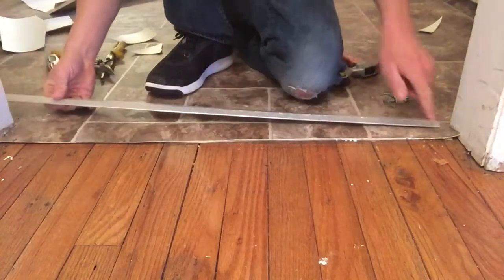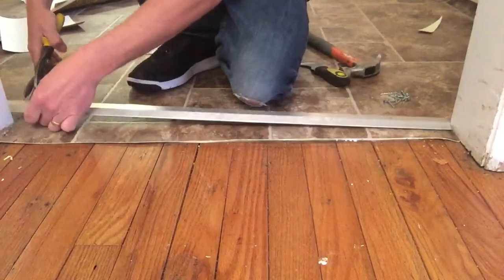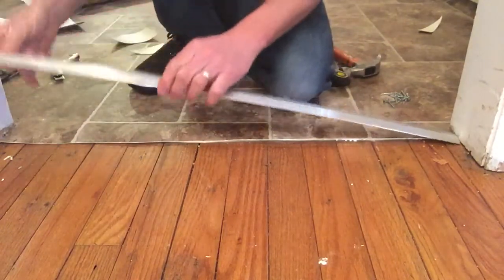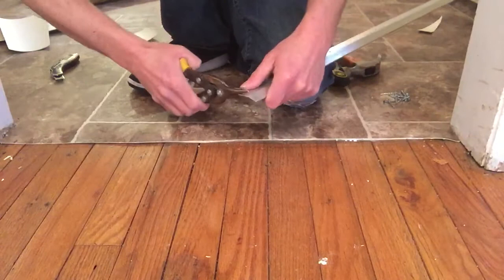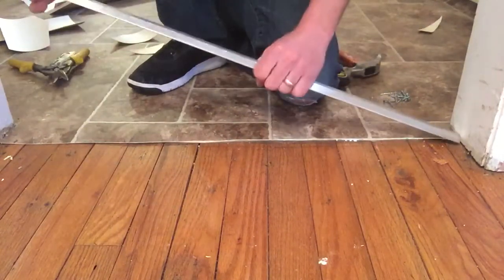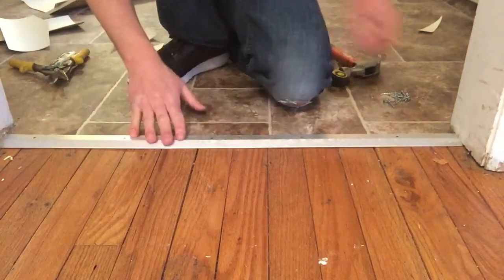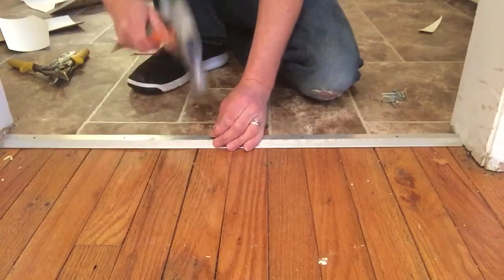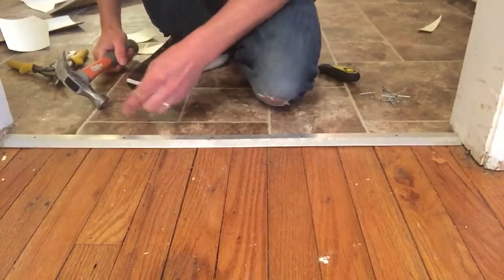So now we got a flat metal, and you can find these at Lowe's, Home Depot, any home improvement store will carry them. I have a set of tin snips. I'm gonna line the metal up to the walls here — I'm gonna cut it a little bit hefty so we're gonna shave a little more off the edge. I'm lining the metal up so the cut piece of vinyl sits halfway in between the metal. And we're just using the nails that come with it, pounding them in, and that's gonna be the finished edge.